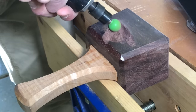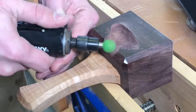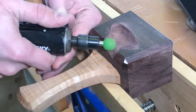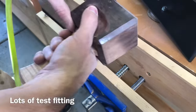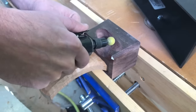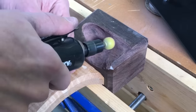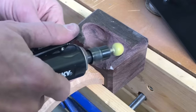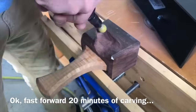They make a bunch of different shapes — I'm using the coarse grit one and I'll switch to the fine grit in a little bit. I just kind of start hogging it out, then as I get further I start test fitting and taking a little bit off here and there. It's a slow process but kind of fun and satisfying. When using different colored wood for the center piece, be careful not to carve too deep. From the time I started to when I finished it was probably 30 minutes to an hour of actual carving and sanding — fairly time-consuming but fun to watch come to shape.